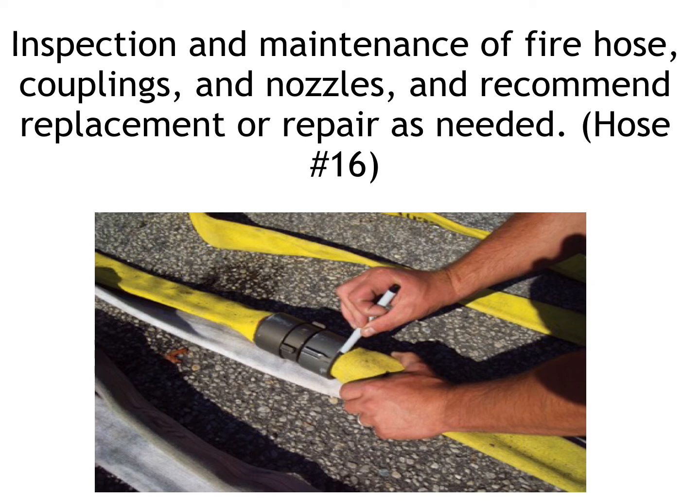Now, the inspection of the supply line is a little bit different. The supply line, you have to test in lengths no longer than 300 feet, but you can connect it to the truck, cap the end of the supply line, and pressurize it up to 200 PSI, no water flowing, and let it run that way for 10 minutes. After 10 minutes, same thing. Walk the supply line, check for leaks, check if it's seeping water, check for bulges in the hose jacket.